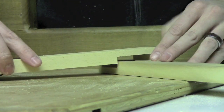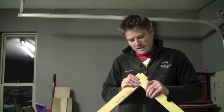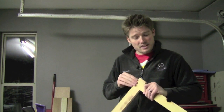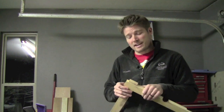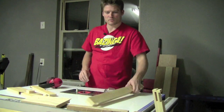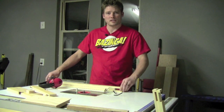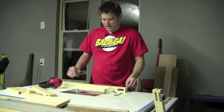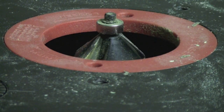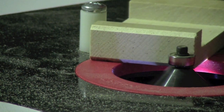Now let's just see how they fit. All right, I believe we have it. Just a little bit of fine-tuned sanding in the joint will make it nice and flush, and then final sanding after that will make it even better. We're about to cut the chamfers that are going to go on the ends of the rails and the top of the legs. The rails on the bottom aren't going to get a chamfer because they're going to get covered up - I'll show you how later. We're going to use our starter pin here on the router with a 45-degree chamfer bit and ball bearing and just run it over the end grain to put a slight chamfer on this.